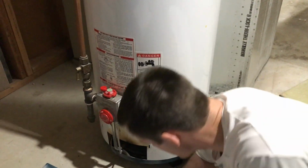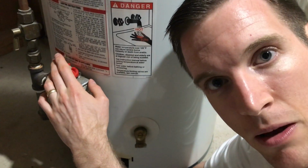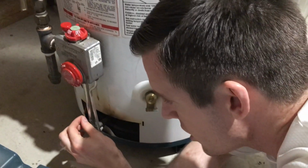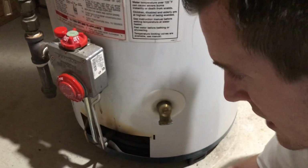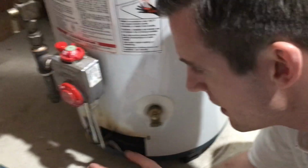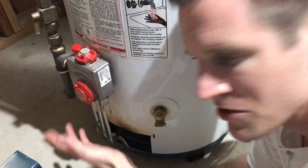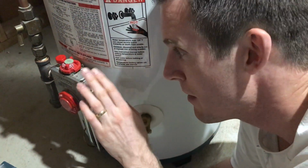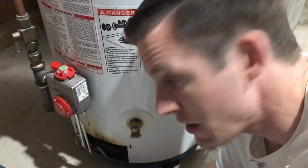So the trick is, when you are holding this down for about a minute, at some point, to just bend this copper wire ever so slightly. For me, that has done the trick. Just by bending this copper wire ever so slightly, that must somehow help send some additional electrical signal to the voltage regulator thing, and keep this pilot light from going out. And so I'm going to try to demonstrate it right now and see if it works.